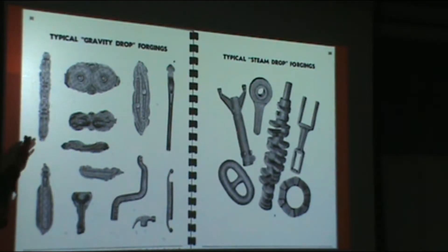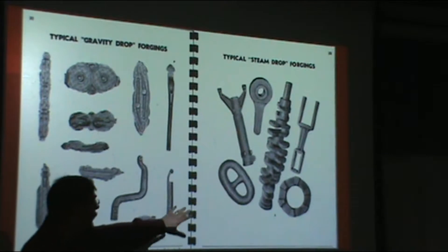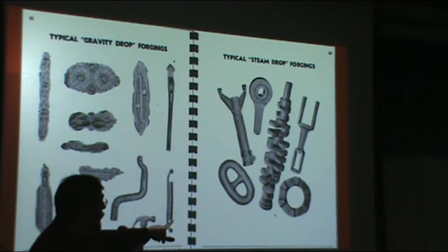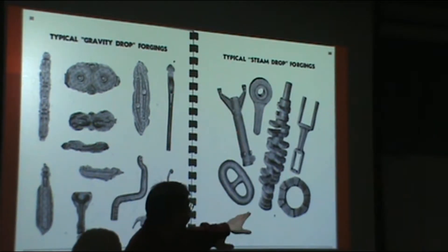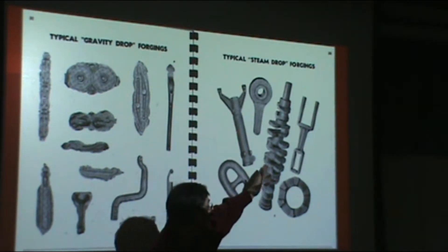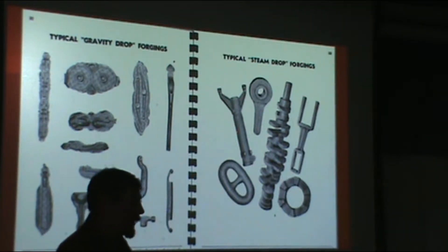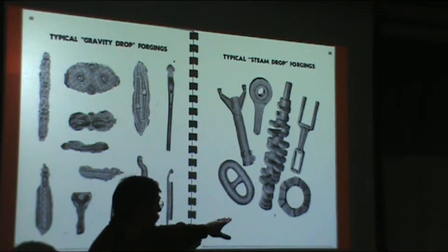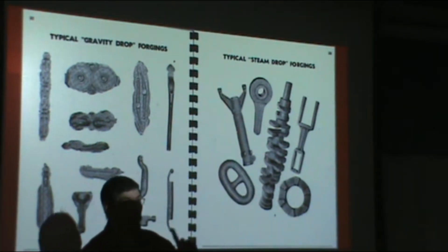Here you can see two chain hooks in the platter, and things that have been forged and trimmed. This is a big crankshaft. When you make a crankshaft in this style of closed die work, you have to design your tools so that all the throws are in the same plane during forging — otherwise you can't create that form with just top and bottom die. What they would do is make that forging and then after forging, reheat it and twist it to get each throw into the correct alignment around the circumference of the shaft.